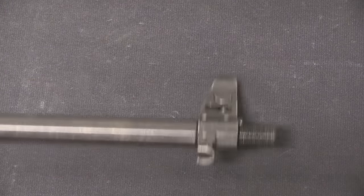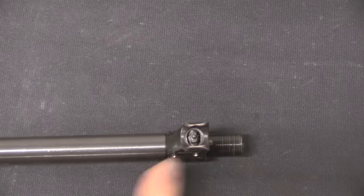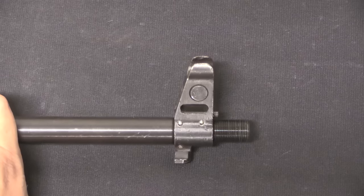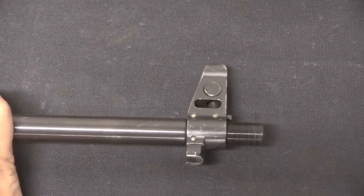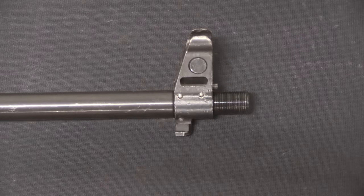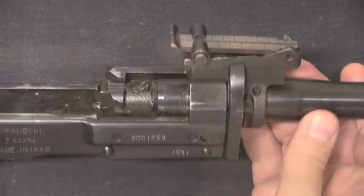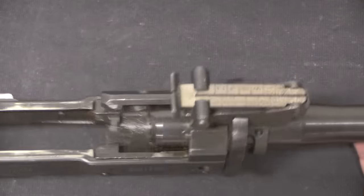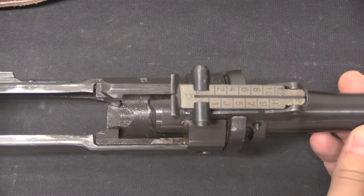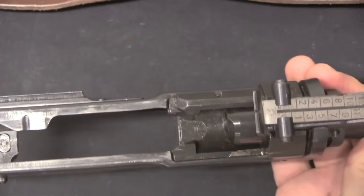This is essentially a Dragunov made on AK tooling. Right at the front is an AK front sight tower — the Dragunov was designed completely independently of the AK, and Dragunov front sights are fully hooded, unlike this AK sight. The gas block is unique, with a short-stroke piston system instead of the AK's long-stroke. The front trunnion is very similar to a Yugoslav M70 front trunnion, the rear sight block and leaf are very AK-like, and there is a trunnion riveted onto a stamped sheet metal receiver — exactly how the stamped M70s that the Iraqis were making were built.